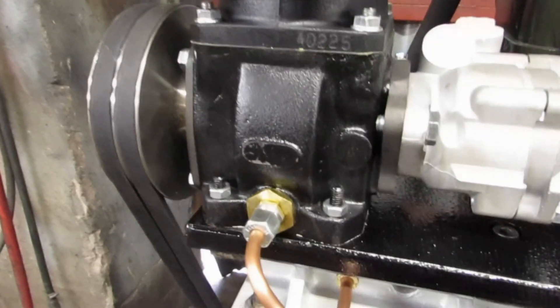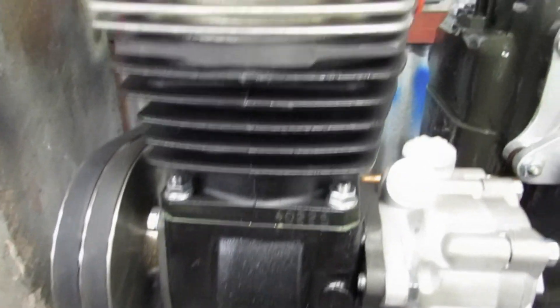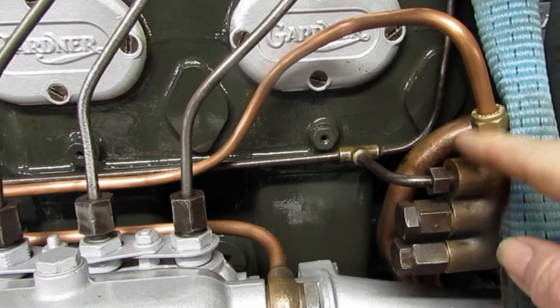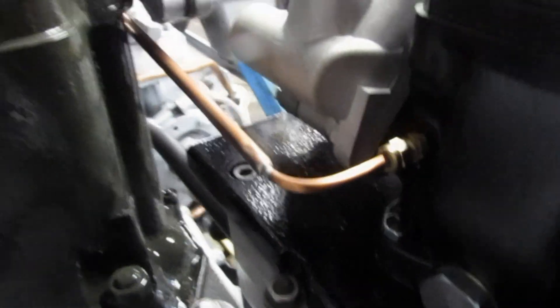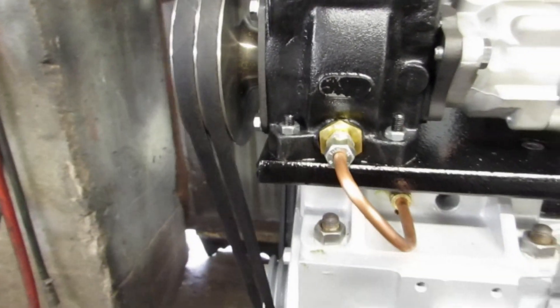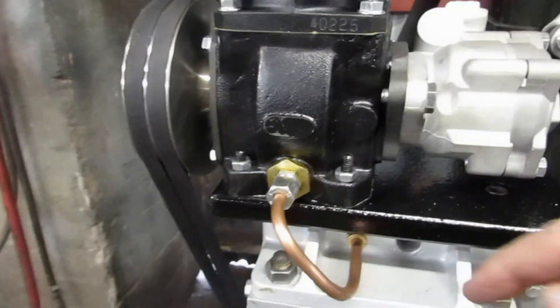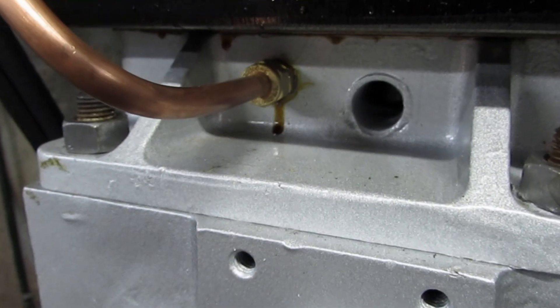It's directly coupled here — there are no belts or anything, there's a shaft running through there. One of the challenges is to get lubrication to the pump. Lubrication is taken off from this manifold here on the outside of the oil filter, follows this pipe all the way along and into the back of the compressor, lubricating the shaft. Our problem then is how does the oil drain off? On the original compressors fitted to the Gardner there was a hole in the bottom of the pump and the oil just found its way down. We had to do this fancy bit of plumbing here, fitting this pipe so the oil returns into the crankcase.